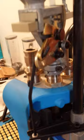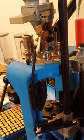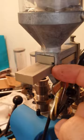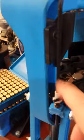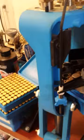The whole purpose of this: because the linkage moved up on the upstroke, now on the downstroke when you come down, that bar is going to pull that linkage down. You can see it happening — when that linkage goes down it forces this charge bar backwards, which allows it to fill with powder. The only thing this is responsible for is just pulling down on this bar to force it downwards, so as long as you've got that set up with some tension when you're pulling it down — it doesn't require a lot of tension, just enough to make these pop back down into position.